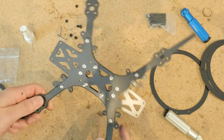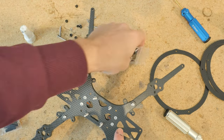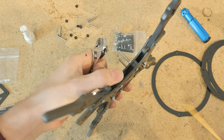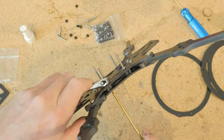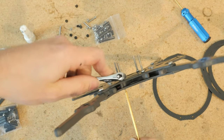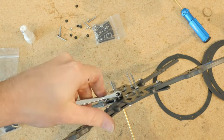We've got both sets of arms connected together. Before we install the 35mm standoffs, since we have extra room, let's use this opportunity to tighten down these hex nuts. I'm using a small crescent wrench and going in from the back side with the 2mm driver. Hold the nut with the crescent wrench and tighten with the driver first, then reposition the crescent so you have room for turning. Once the screw is in all the way, turn the hex nut with the crescent wrench to add that extra bit of tightness. Don't go too hard on these — it's only M3 screws, especially in the stainless steel variety; they strip easier with stainless.